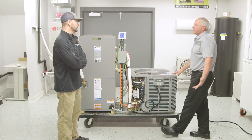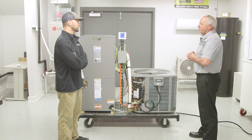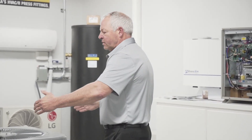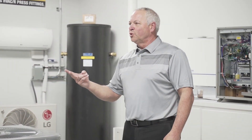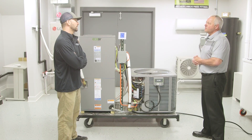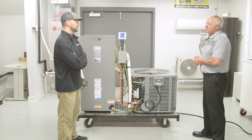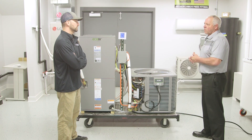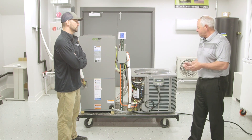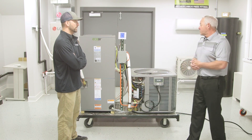The benefit in today's economy: comparing against ultra-high-efficiency 18 or 20 SEER equipment, that unit could be as much as two times taller and possibly wider — it literally takes two individuals to move it and you may not even get it through the gate going to the backyard. As for decibel levels, the rating is approximately 55 dBA in cooling mode on a five-ton. Right now you and I are probably talking at about 65 dBA, measured approximately three feet off the ground and three feet from the equipment. So it's super quiet — very quiet as a general rule.